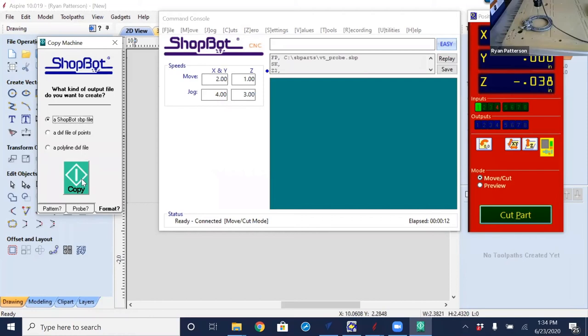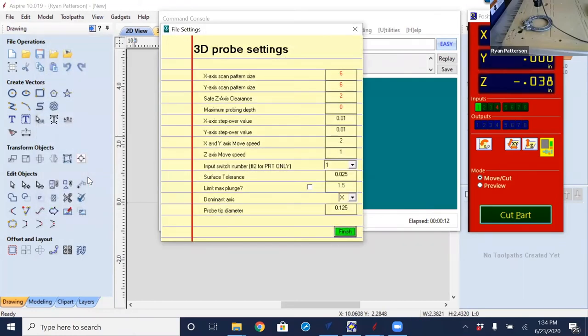So with that done, let's select copy. We have many more options here. Again, the pattern size, that is the 1 7/8 in the X and 2.5 in the Y. The safe clearance Z, I don't want to have that very high, but I want to make sure it's high enough to be able to clear the model or the part. So I'm going to enter in a safe clearance of 0.5